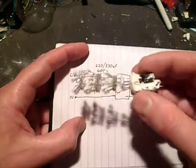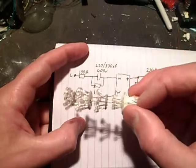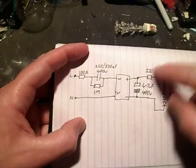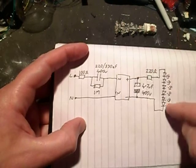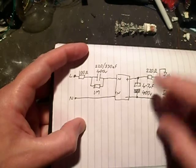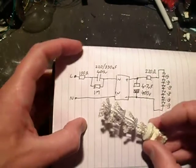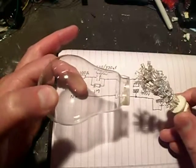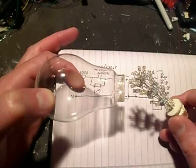It uses a smoothing capacitor — typical compact fluorescent lamp style, 400 volts, 4.7 microfarads. Then there's a 220 nanofarad capacitor on the outside, which is just to limit the current through the LEDs. And then it's just a solid string of LEDs — very simple. Very neat lamps, quite expensive lamps, but well worth the money. These are the Calex LED decorative lamps.